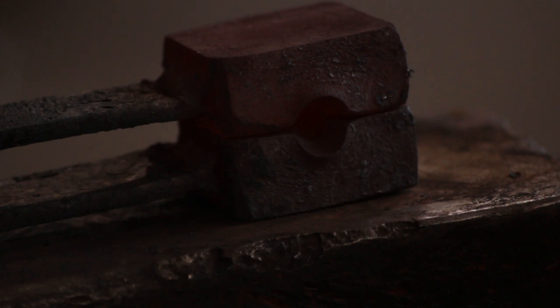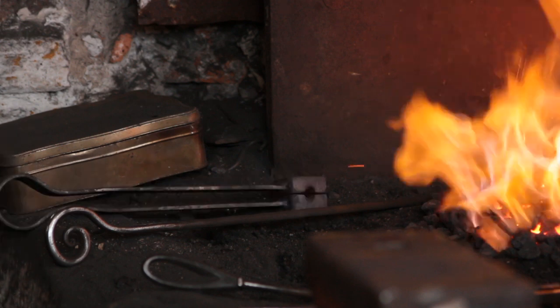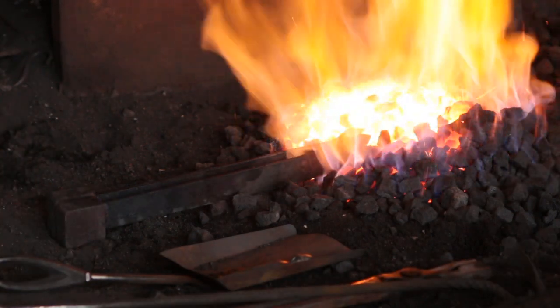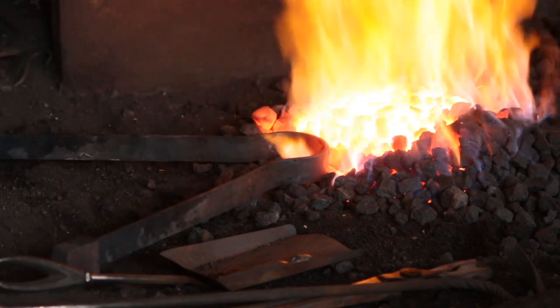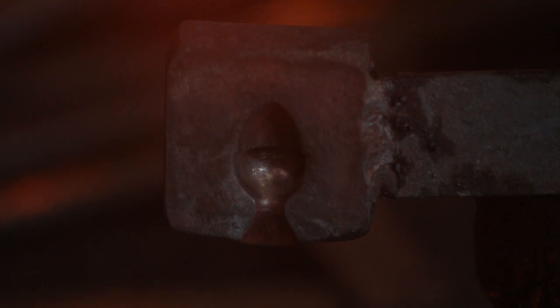That's all formed up. I'll just lay that to one side to air cool — go have lunch or do some other work whilst that's cooling down. I'm not annealing it, just letting it soften on its own. When it's cooled down I'll heat up the spring and at a dull red heat I'll open it up, because at this stage I want access to both sides of the impression. And as you can see, that's nice and crisp — a lovely even shape, and that's from rotating it.